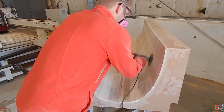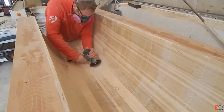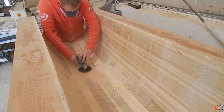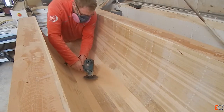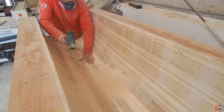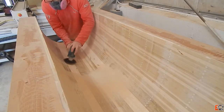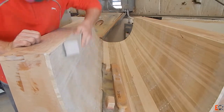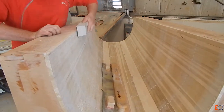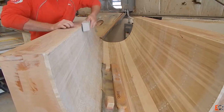Then came the fun part. I went over it all with a disc sander and some coarse paper and got all the glue. This was by feel pretty much — at this point I'm leveling down that centerline strip. After about an hour of this I had it pretty nice. It pays to get as much as you can at this step because it's a lot easier to fair now than it will be when it has glass on it, and there's no risk of burning through the glass and causing vacuum trouble.